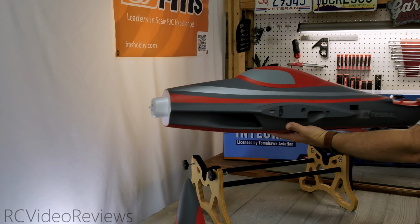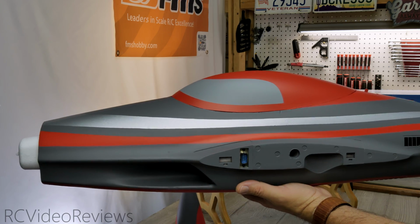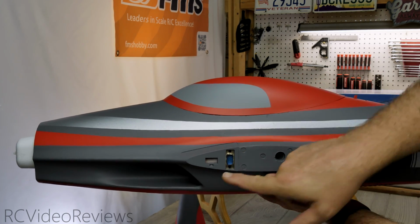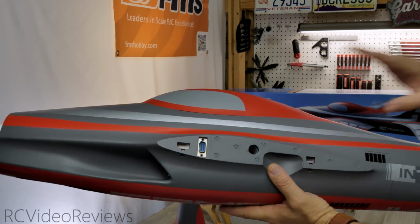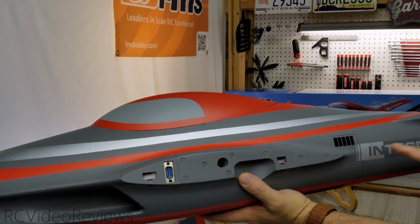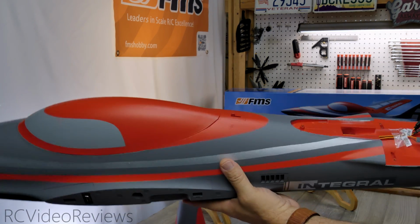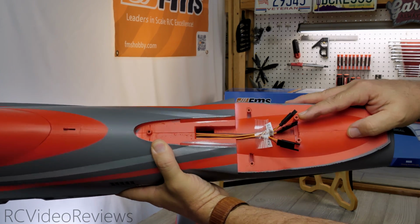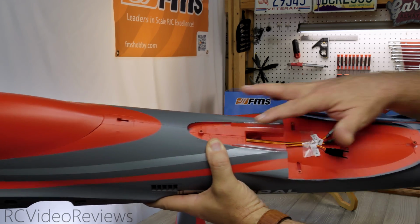And then finally, we've got the fuselage. We'll just take a look at the outside and inspect it for quality first to make sure everything looks good. Remember the 9-pin connectors right there for the wings? That's where they go. And then the wing inserts go right there, and they screw in from the bottom. So very clean and simple assembly. I like that. You've got a little air intake right here, the integral marking on the back. And then, of course, on the empennage or tail section, there's brass captured screws for the vertical and horizontal stabilizers right here, here, and here.